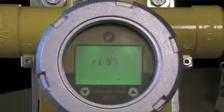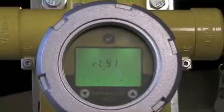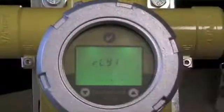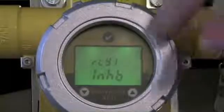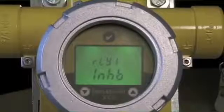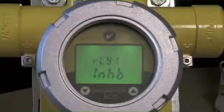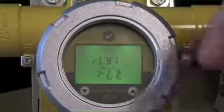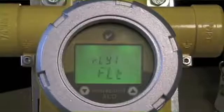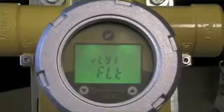Next is setting the relay functions. Relay one is associated right now with alarm level one — we're mapping certain conditions to one of the three relays at the back. Each relay can be associated with alarm one, alarm two, inhibit (indicating maintenance activity), or fault. For inhibit, you can engage a relay when you're in a menu or doing a calibration, pulling that as a contact closure into a control system to indicate maintenance. Or you can map it as a fault, indicating something is wrong with the sensor, giving you a contact closure when it's not doing its intended job.